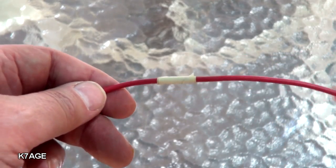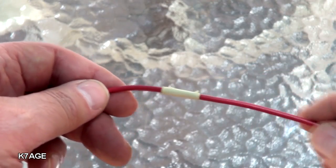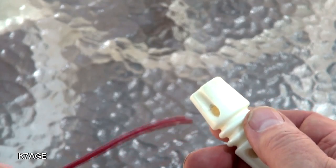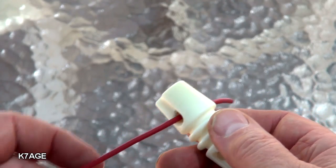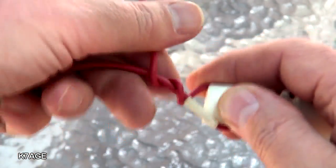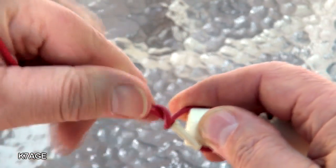I'm not going to show you all the details about putting the antenna up. I've marked with some tape on the wire at the 8 foot 3 inch area, which is where we calculated to be the correct length for the antenna. You can pass the wire through the insulator and wrap the wire back around on itself — no cutting, no soldering, just wrap it back around on itself.